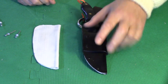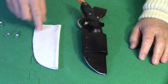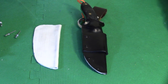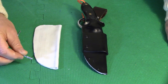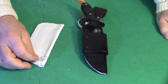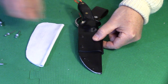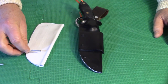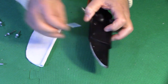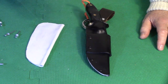The rivets I'm going to be using for the main body are 5/32 by 1/4 inch aluminum rivets. For the reinforcing area where there are more layers, I have 5/32 by 5/8 inch aluminum rivets — that's long enough to go across the extra thick area. There's a reason why they're longer than the material thickness, which I'll show you when I get to the riveting stage.